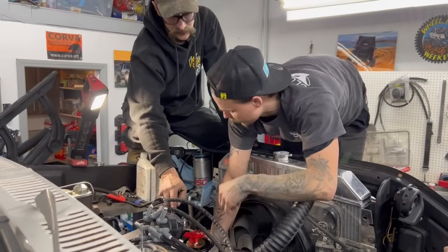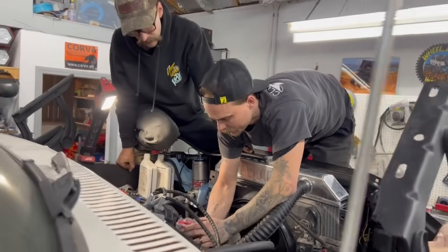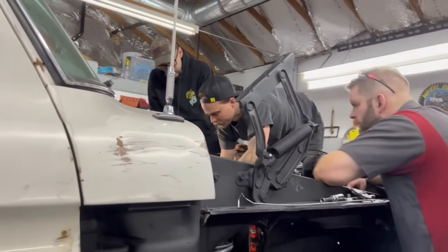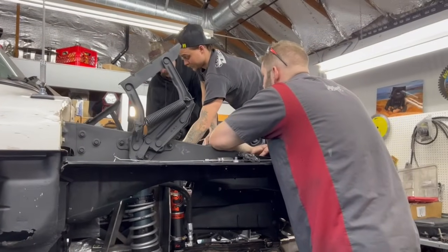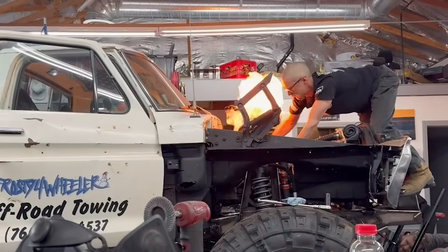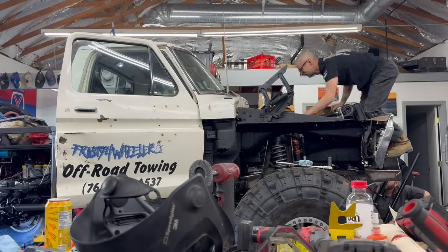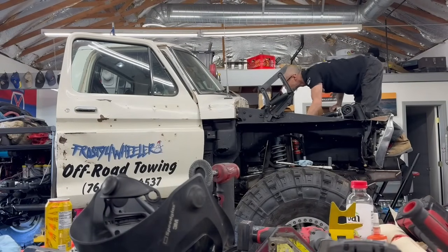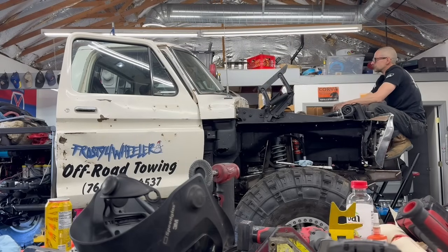That's it. Okay. That's it. I don't know if this fell or not. I don't know. That would be the noise. Yeah. It definitely came from there. Right, go. It's a good thing your hair is shaved. No, the backfire on the intake is usually timing. Yeah. That's why I think we need to go a tooth over.